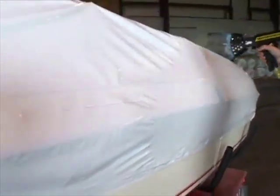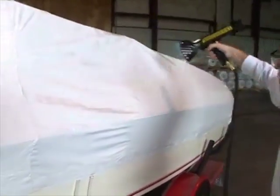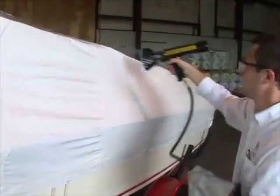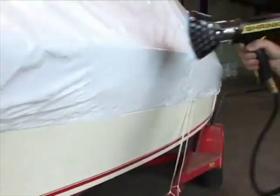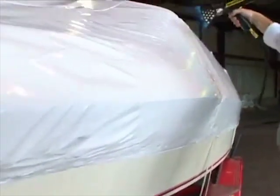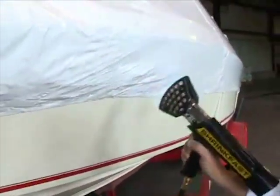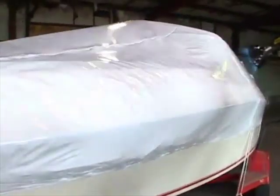You can see Ryan is hitting the film nicely — it's very similar to spray painting where you're applying heat in the same kind of fashion. You get the material to start shrinking, and where it's not shrunk you'll see wrinkles form, so it gives you a clue as to what you've hit and what you've missed. Same thing around the bow — we'll do this around the entire boat, and then come back and put an extension on the heat tool and shrink the top. The same principles on shrinking this boat will work on larger boats also.